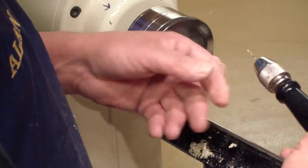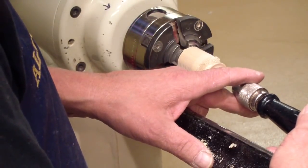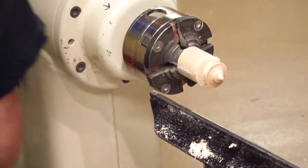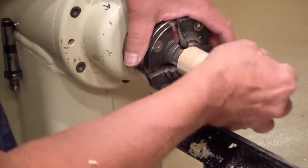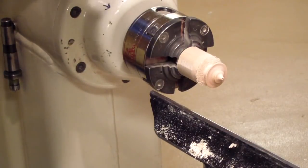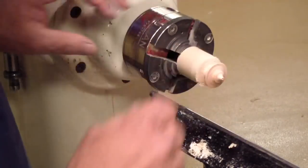With really hard woods, I have to wobble it out a little bit. I'll rock it back and forth and open it up a little, like with diamond wood and some of the other hardwoods, to make sure the screw eye fits. And if you're smart, after you've sanded it, go ahead and put the screw eye in now, because I can spin it. If you do it off the lathe, us old folks can't do this anymore. It's a whole lot easier on here.